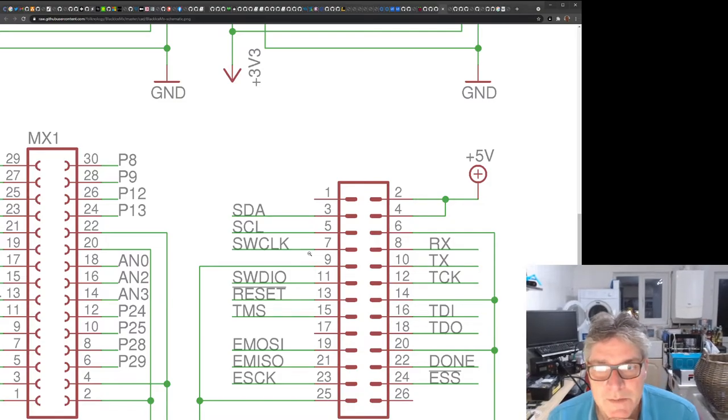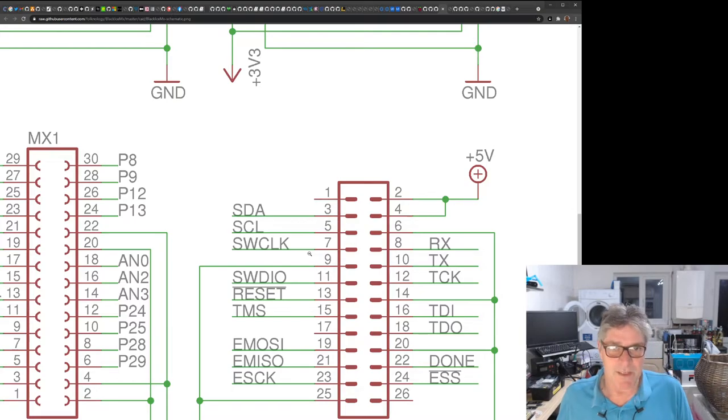What was I saying? Oh, yes. So in those days we had the choice of either using SPI to program and communicate with the iCE40 or the STM32. Some people did it, but not many. So in the end, that kind of got deprioritized. I mean, it would be possible to repeat that connector on the tile board, on the Black Tiles, whatever it's going to be called, rather than just have the straightforward debug connector.